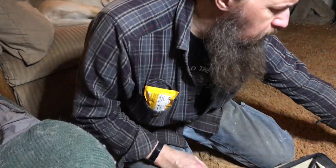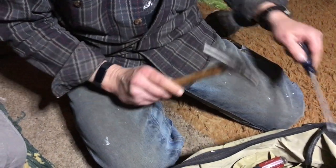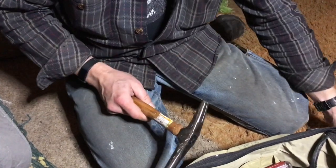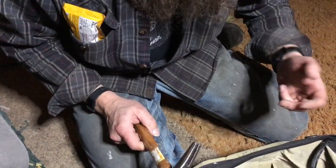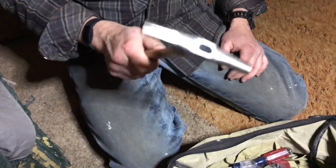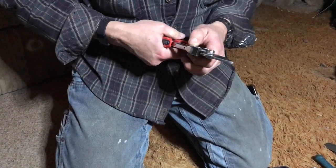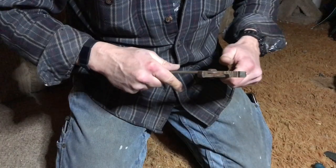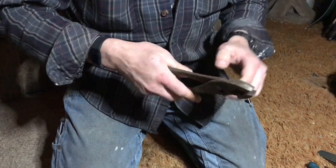This is a tack hammer. I wonder if this is one of the magnetic ones. Yep, still got its magnetism. For doing upholstery and stuff — this is effectively a horseshoe magnet, so you take your upholstery tack, stick it on the magnetic end, whack it into place, then spin this around and drive it in — extend the handle for greater leverage. A lot of the hatred around slip joint pliers is that after they get some wear and tear, the joint will just collapse at the worst possible moment, and you get blood blisters and mangled fasteners.